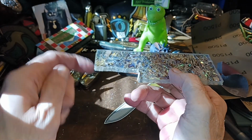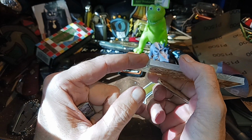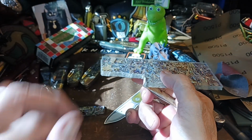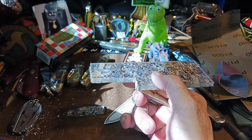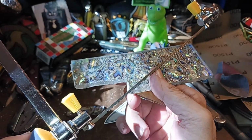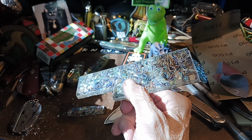So I took a high-speed Dremel tool with a cutoff wheel, and I started doing this. First mistake: when you go high speed on plastic, it's going to start melting. And when something starts melting, it cuts differently than something that wouldn't melt. So I quickly gave up on that and said, all right, I'm going to have to use something not high speed. I'm going to have to cut it. What I used, which is really not the best thing for this either, was this saw right here. The teeth really should be finer than this for what I'm dealing with. I really should have used a hacksaw. But anyway, live and learn.